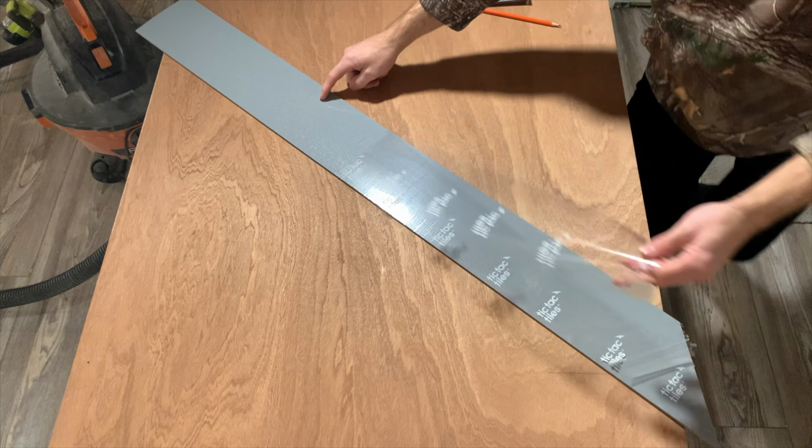Now, there's going to be a small gap between the perimeter boards we just installed and the Renoboard product that we applied previously. So to fix this, I masked off around a quarter of an inch inside of the perimeter boards, and that is gonna help to keep the caulk that I fill that gap with from going all over the place. It's gonna hopefully make it pretty neat and crisp. I used my finger as needed to spread the caulk around, and then I took some black paint and painted the entire perimeter of the barn door.